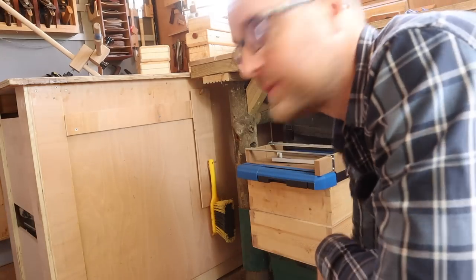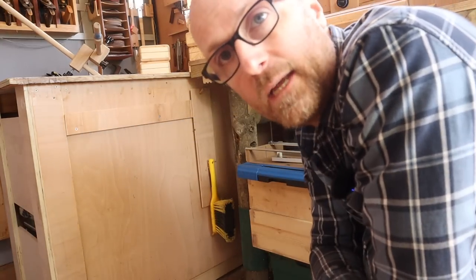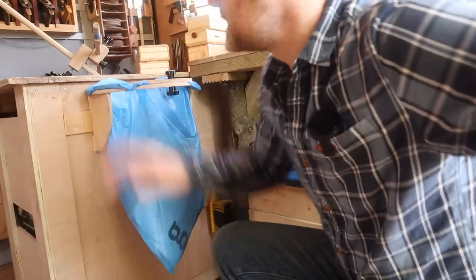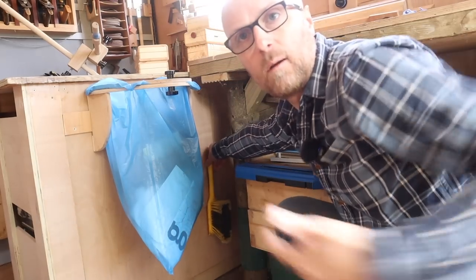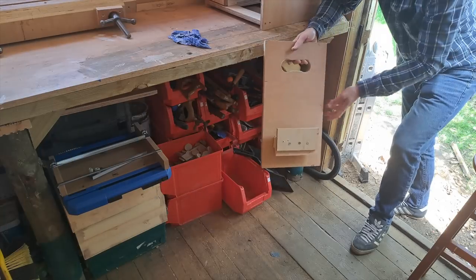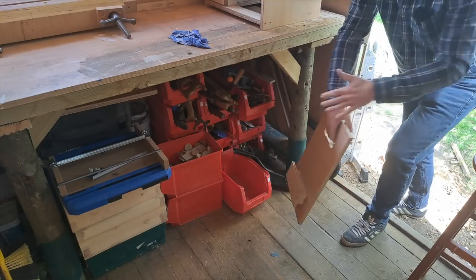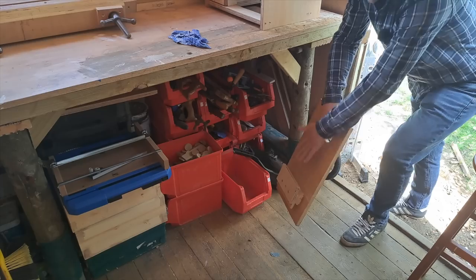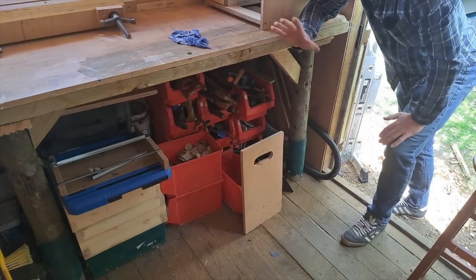This is the side of the workbench that you see me working off. One French cleat — and what that means is I can stick my bin on it like that. It's up level with the workbench so I can sweep stuff into it. And down here I've got my brushes for it. Pretty good for workflow. This is for carrying sheet goods: sheet goods stick in there, hold it with a straight arm, and you can carry easily a sheet of plywood without any problems.